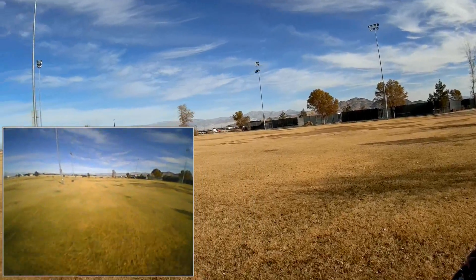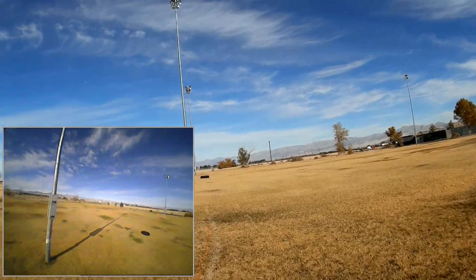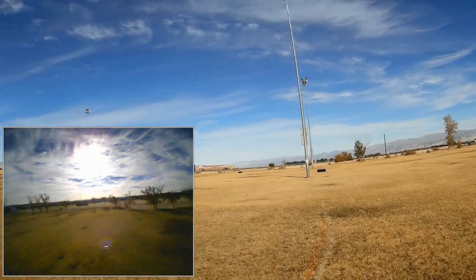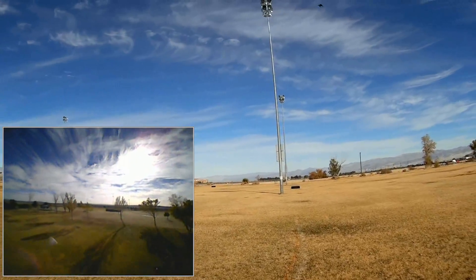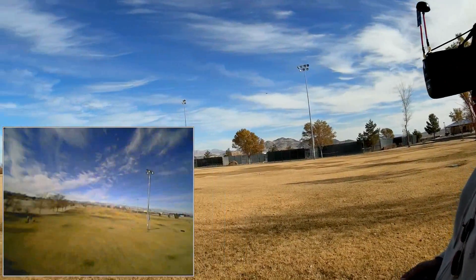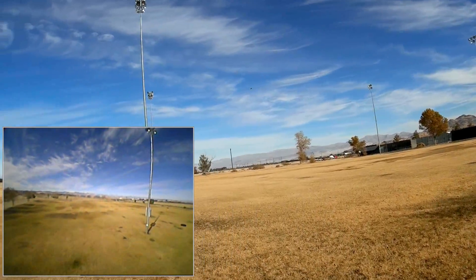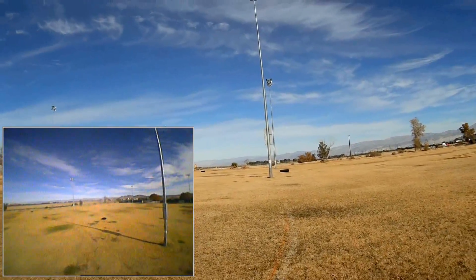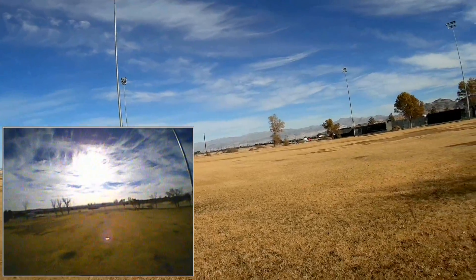I don't want to hit myself, I can hear it close. We'll go around the pole one more time. This is what the FPV camera looks like, recorded on my VRD2 goggles. I had a hard time tuning these goggles to this — I had to really change the dip switches on the quadcopter for the FPV quite a bit before I found a frequency that would tune up with my VRD2 goggles. I don't know what the issue is there — maybe others who get this will want to take a look.